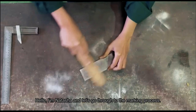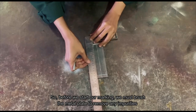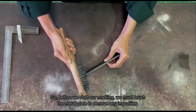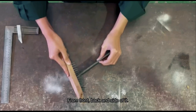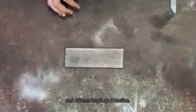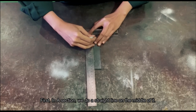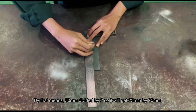Hello, I'm Natasha. And let's go through the marking process. So, before we start our marking, we must brush off the metal plate to remove any impurities — from front, back, and side of it. From this plate, let's say the 15mm length as A section and 115mm length as B section. First, in A section, we do a straight line on the middle of it, by that means 15mm divided by 2.